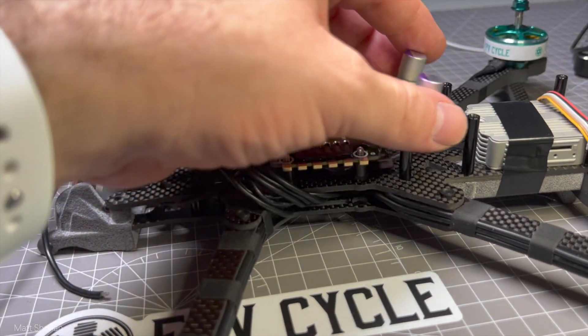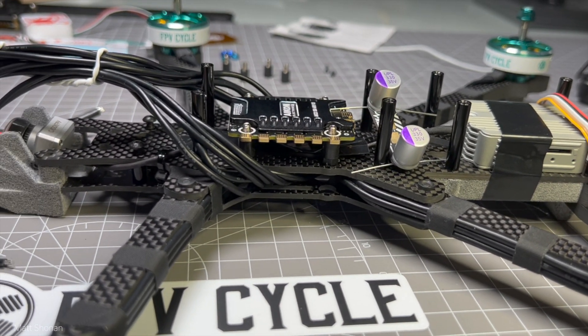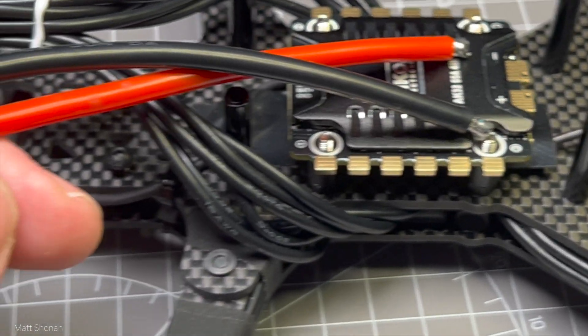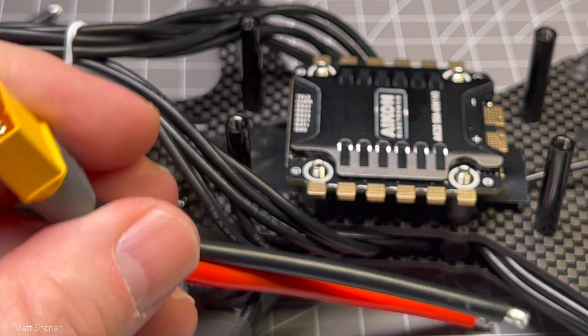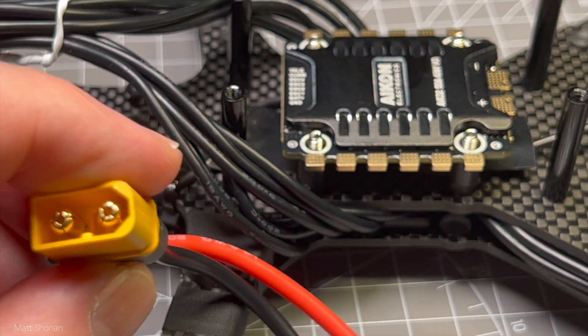A main difference for this build is that we have more space in a 7 inch frame compared to a smaller frame. For protecting our electronics we have a spike absorber — 3 diodes flanked by 2 capacitors — which will live right between the DJI air unit, our ESC, and the flight control board.